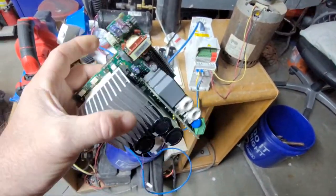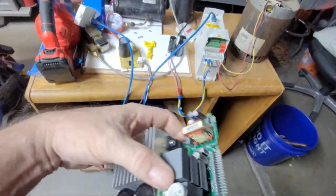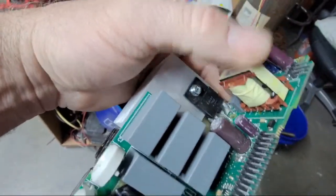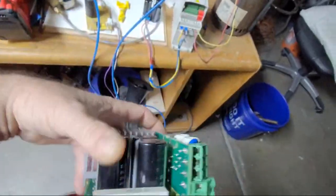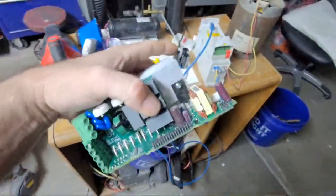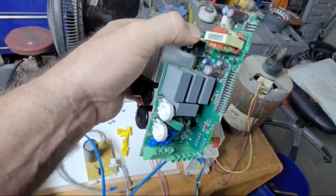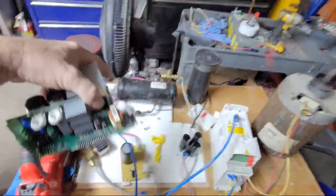And then, electronically, once it gets going, it just uses some switching stuff, which is what this is obviously doing, switching this to make the stable low voltage. It's obviously feeding through it with a resistor, which is probably this, before the relay closes or whatever. I'm guessing it's doing something to activate your low voltage electronics. As soon as you put power in there, it's bleeding it from the high voltage somehow through some resistor network. And then as soon as it gets it, it activates the switching thing. So you're taking high voltage. Ooh, almost put my hand in there.